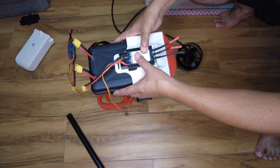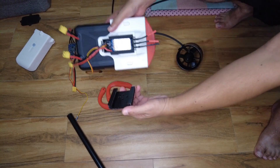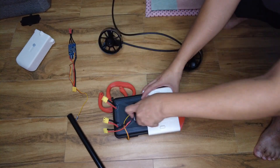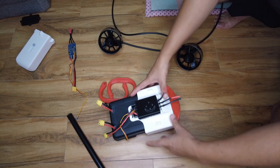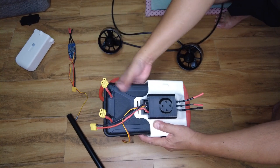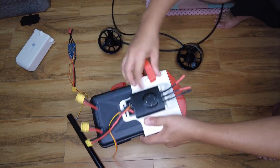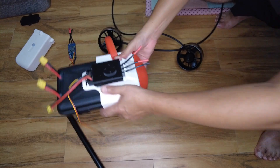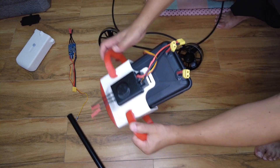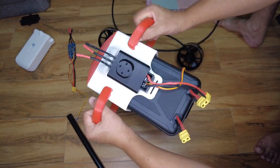The ESC will sit in here and the thruster will be installed on top using screws. Everything locks automatically except the box, which I will secure with velcro so it doesn't pull out. After that I just put on these handles, which I also designed so they can be removed. And there you go — you have your underwater thruster, or sea scooter, that you can use to dive underwater effectively.